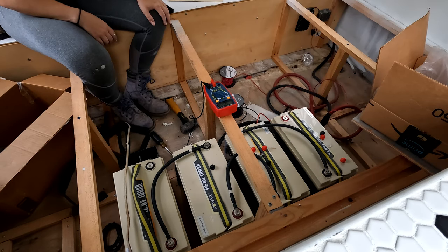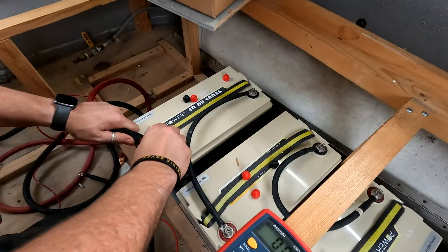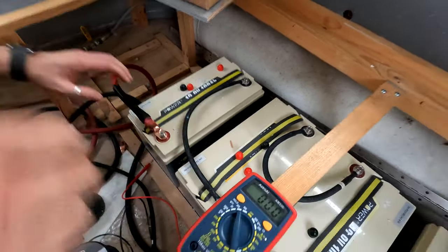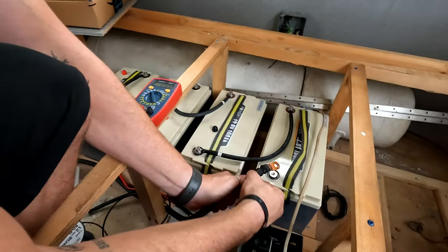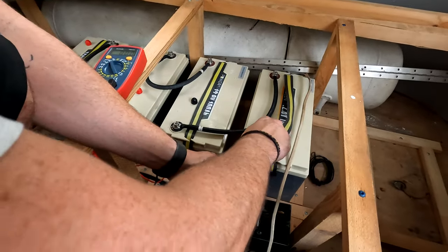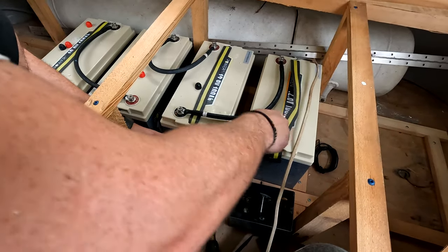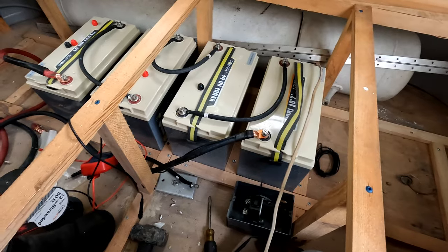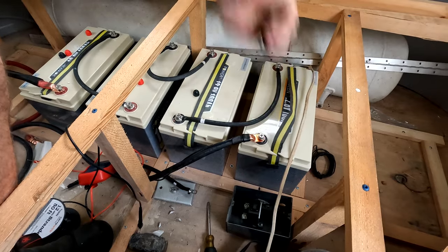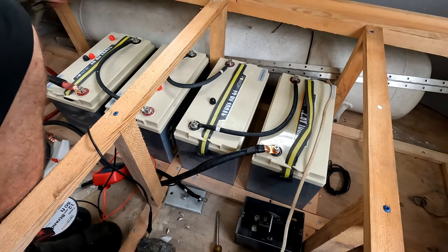I'd say we're at either 14 or 15 volts so I'm going to set it to 16. All right, that's the red. Then you go down like that — whoa. All right, now we should have some beeping at some point. I need to go and reset it and change the lithium type. Okay, so this should be a 48-volt array.